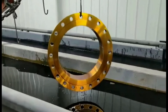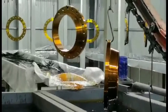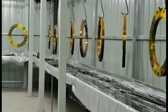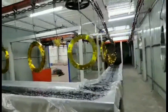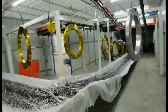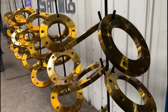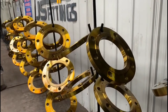You can see the color is very beautiful — a golden color. It's a golden flange, a very good color. Now we need to make the flange dry quickly. Each flange goes into the oven, which is very hot — the temperature may be around 150°C. You cannot touch it with your face, it is very hot, and the flange will stay there for half an hour.